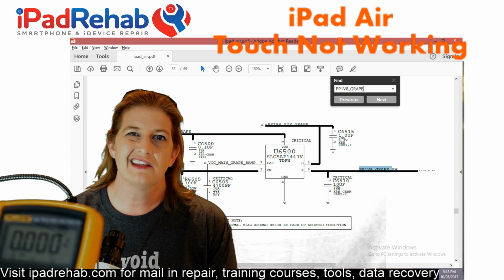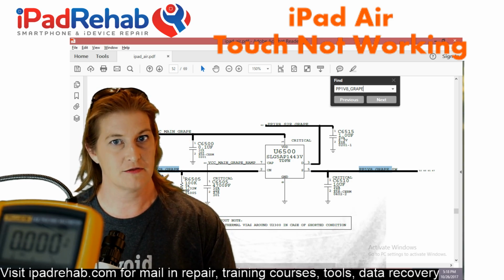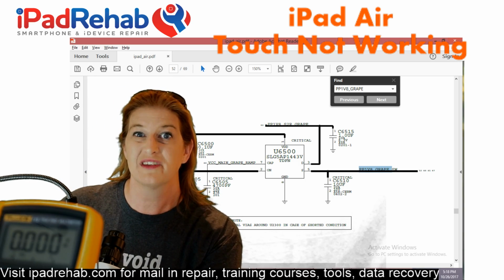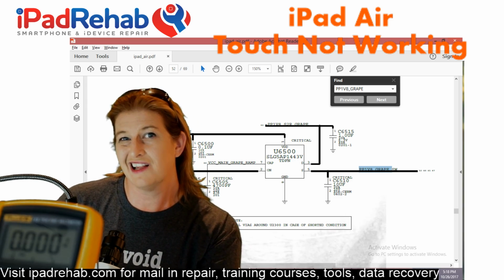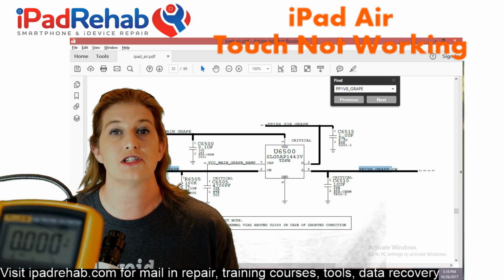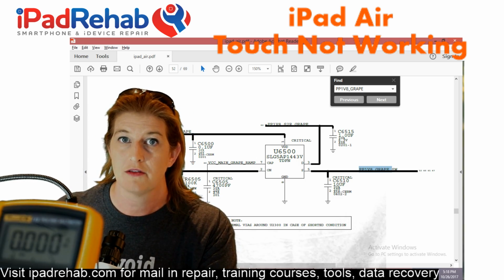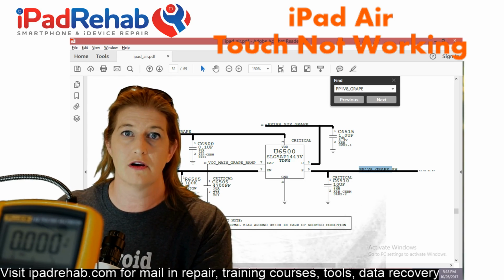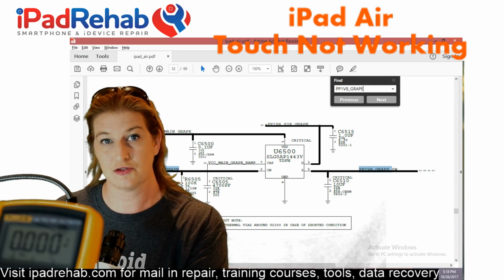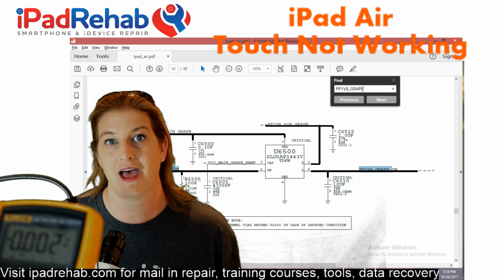There theoretically could be a reason that the PMIC is not putting out this voltage, because it doesn't do it unless it is told to, probably by an interaction with the CPU. It's likely there's some kind of logic or control that says, don't bother wasting your energy putting out a touch voltage if we're not going to use touch. The CPU may say, as far as I know, there is no screen attached, or the touch is disabled, or who knows what. There may be some kind of data line logic control that's telling the PMIC not to put out that voltage, and therefore it trickles down that we're going to have no power to touch.